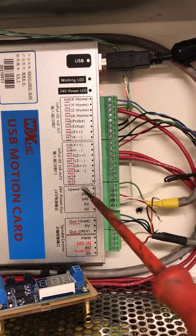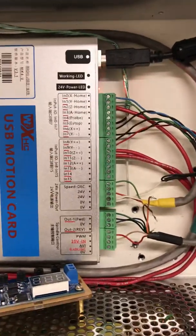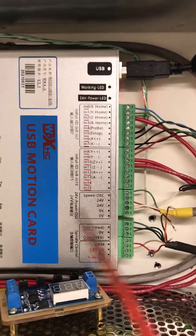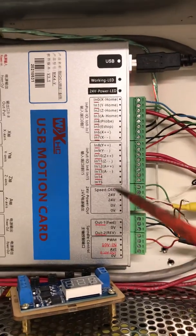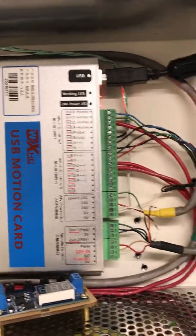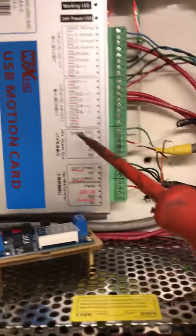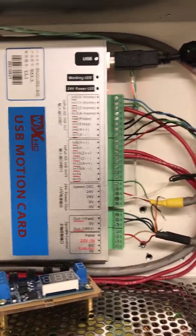From 5 up to 24 volts, as soon as you hook up a proximity switch to that dedicated input, it will automatically send the index signal over to Mach3 so you can see it. That's how I tested it. This is in case some of you have this control card and you're having trouble getting the index signal working on input 14, 15, or whatever input you're trying to use — it really didn't work for me that way, but it might work for you.